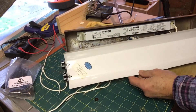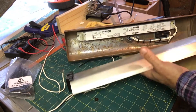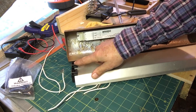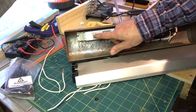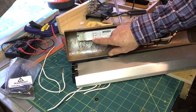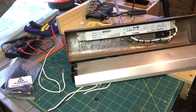I've stripped and removed all the wires and refitted the fittings, because I think it'll be easier to lay the wiring out with those in place and get the right length. According to the circuit diagram I'm going to call this lamp one and this one lamp two, starting from the top. These two at this end are chained together, and one wire is run from this point all the way to this other point. Let's put that bridge across first and then run the wire along.